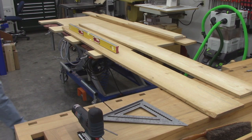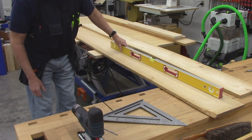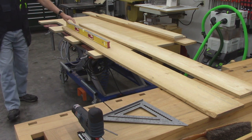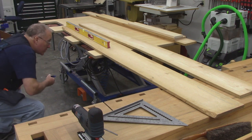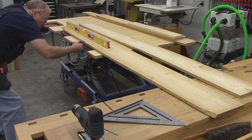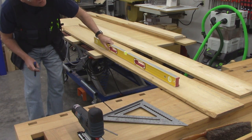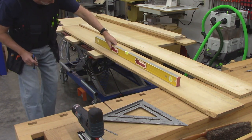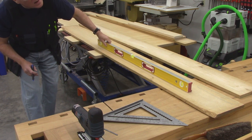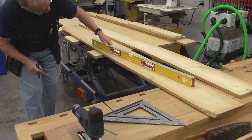What I like to do is use a level, some type of straight edge. Levels I like because they stand up by themselves. This one has a bow in it and what I'm looking for is just the flattest sections of this board — find out where that bow starts. I'm fairly flat here and all I'm doing is just looking at the gap underneath the level, trying to maximize my thickness. This is fairly flat here, maybe a slight dip in this area, very slight, and then it goes wonky at the other end. I'm getting some twist here, maybe a little bit.